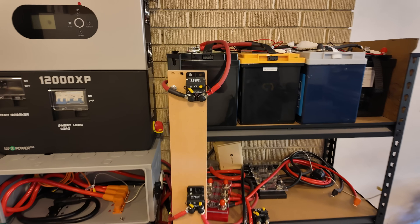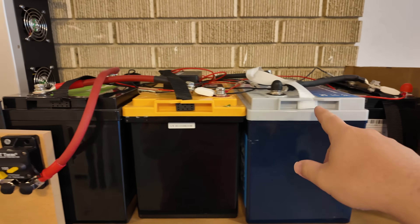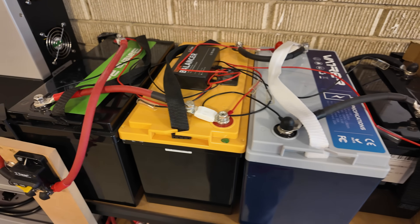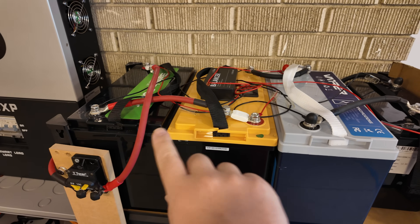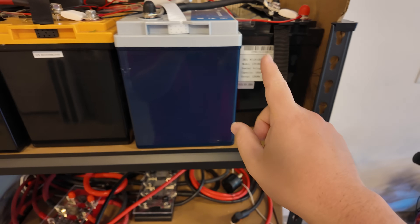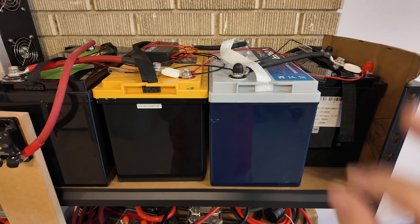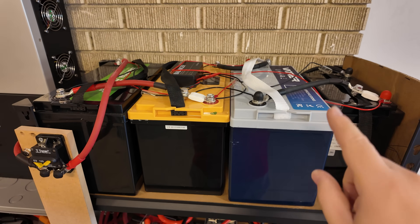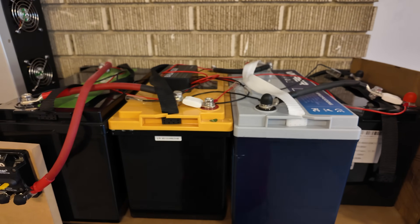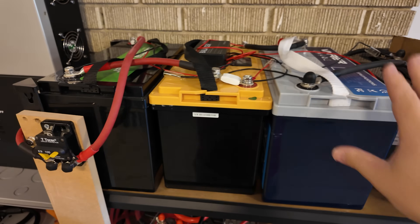The calculations are very, very simple. Let's use this top row of batteries — each is a 12-volt lithium iron phosphate battery. I have four of these batteries connected in series to create a 48-volt battery pack. The voltage is the pressure. Each of these batteries is rated to discharge up to 100 amps of power — that is volume of power. Because I have 48 volts of pressure with 100 amps of volume, I need to size my wires to accommodate that volume. The maximum power I could safely draw from this bank is 100 amps.